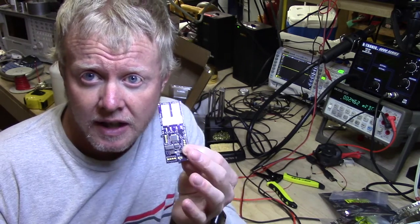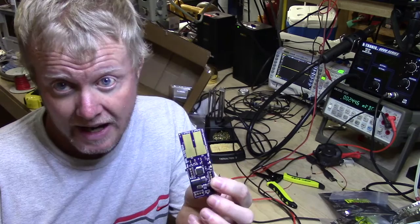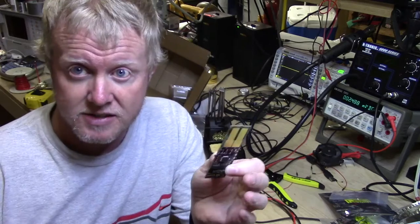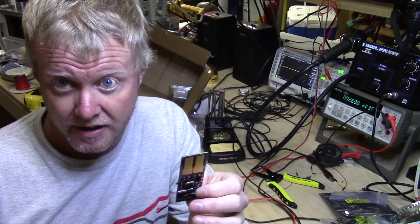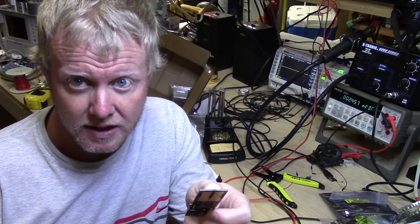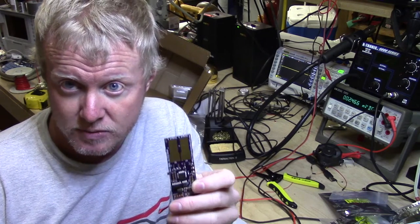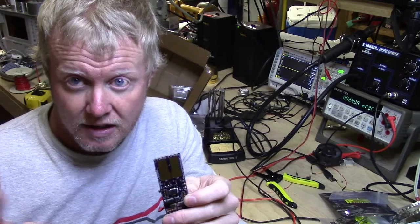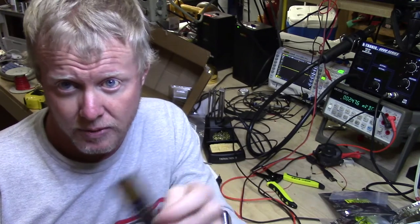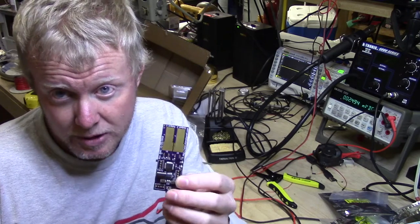Again, I still plan on supporting this in standalone. And basically what that means is if you've got a RZR and you just have literally one or two things, and that's a majority, that's currently what I have. I don't have a radio or anything like that yet in this particular RZR. Now, my old RZR, I had tons of stuff in it. But again, I had the huge multiplexer and I had it all hooked up. My current RZR, you basically have winch power to the relay. And that's not what actually powers the winch. It's just what powers the solenoid that actually kicks over and engages the winch. So I have that. That is an accessory output. And that right now I have attached to a regular lighting relay. Also, I've got an LED light bar and that consumes quite a bit of amperage.